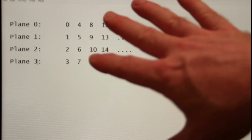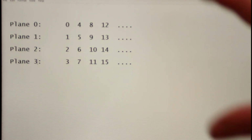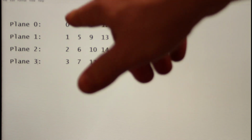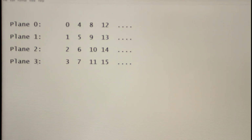You have to do a little bit of mathematics to check this, but the effect is that everything just moves to the left by 1 pixel. So just by changing one start address, I can do a shift of the entire screen. And if I repeat this process, I can scroll to the left very, very smoothly. Similarly, if I want to scroll up, I just have to move the start address from pixel 0 to pixel 320, and the whole screen will move up by a pixel. So I can do vertical scrolling smoothly as well.